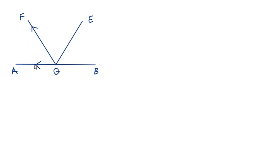Okay. Therefore, if I go to the left hand A, the other side of A is looking like this. But I'm not concerned about that. The other side of A of FG is looking like it. I'm not concerned with that. So don't draw it in. You are going to confuse yourself. Okay. Right. So FG we know. It's tension, pulling away from the joint. And AG is also in tension, pulling away from the joint.